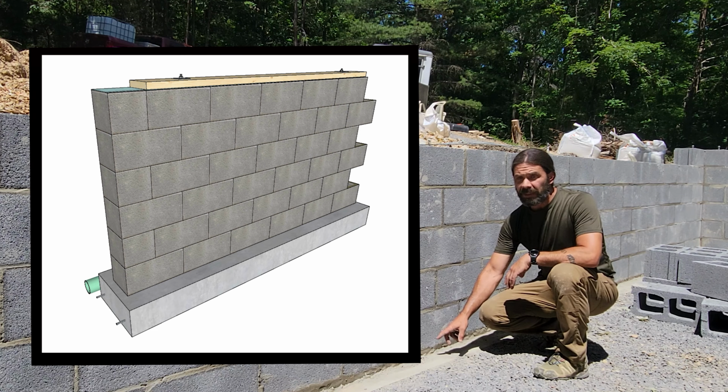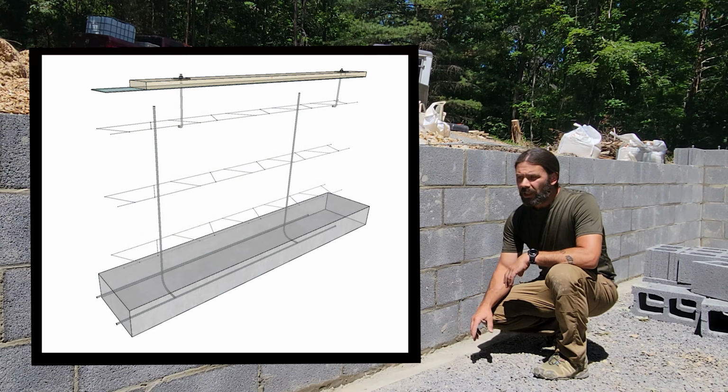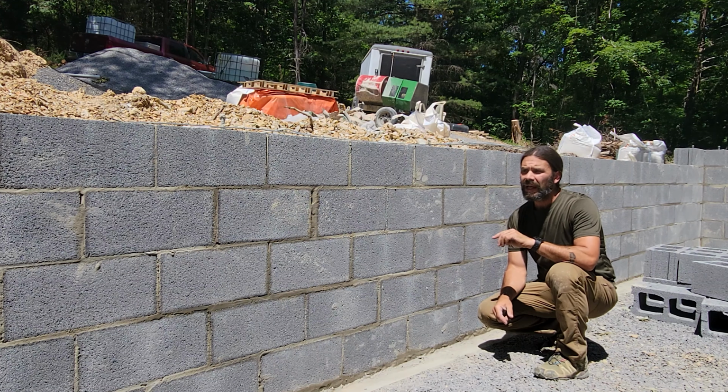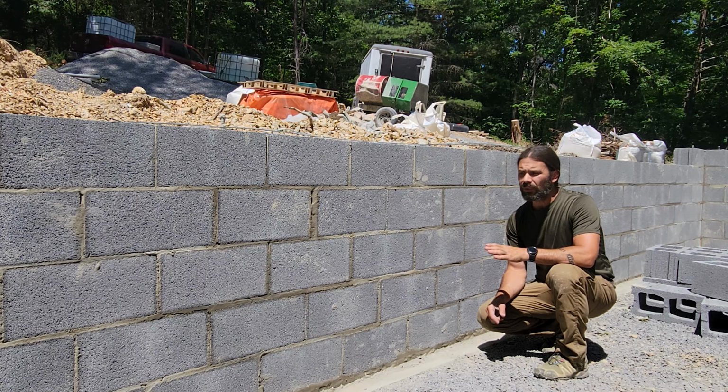And typically that has to be done before you pour the concrete, because that rebar has to come down and kind of hook to or bond to the horizontal rebar in the footer. They didn't do that here. Not only is it just more complicated, we had lots of corners. I was lacking formwork to really pull our measurements off of and working against time. So if I didn't lay it out just right, it'd be cut off and redone like we're doing now anyway.